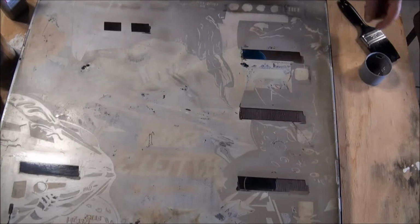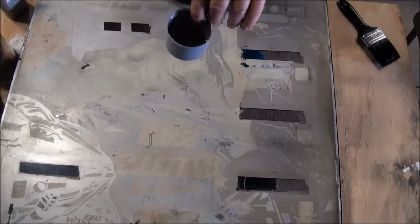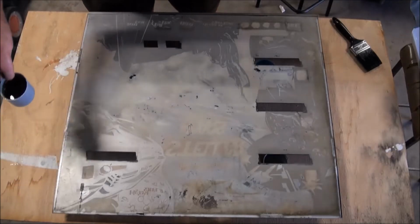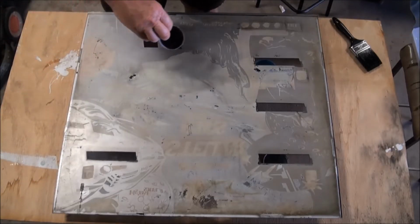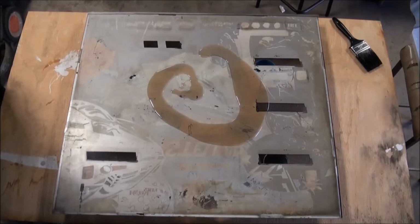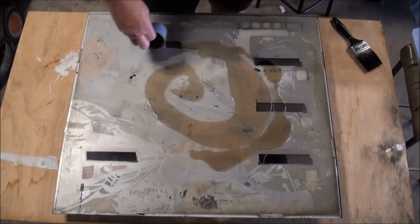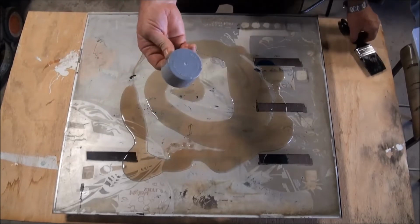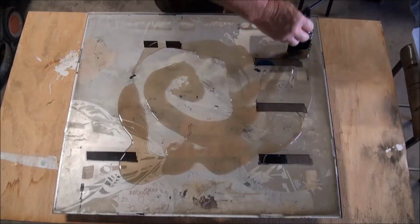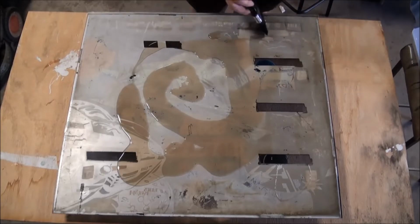Now with this bigger glass, you're going to probably want to use 1.5 of these, again, pressure pack lid for convenient size reference. Okay, so this glass is dry and ready for the Markseal. So again, I've filled one of these up about 3/4, maybe a little more. So we just pour that on. Now this will need about 2 of those. So I'll just get the second one. And again, just pour it anywhere you like. And this one will be quite easy. It's pretty secure, so you can just gently spread it out towards the edges. Don't worry about any that goes over the edge.